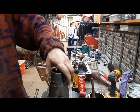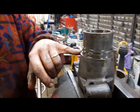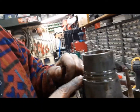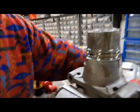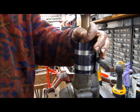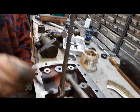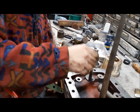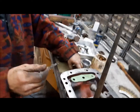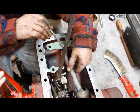We'll get this piston in there — I've just got to grab my ring compressor. What's also important is there are three rings, so you want your gaps basically every 120 degrees — you want to stagger your gaps. We've got our ring squashed. In she goes — oh yeah, that feels nice in there, we'll have no trouble with that piston. Now for the gasket grease: one gasket goes here, and two little ones there. We'll put a little grease on the end of that just for good luck.